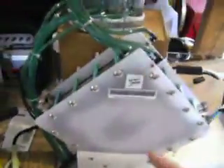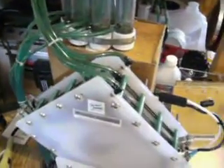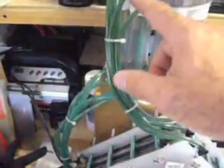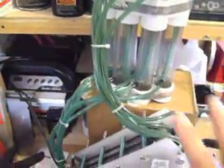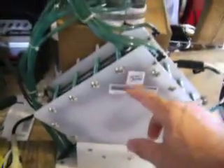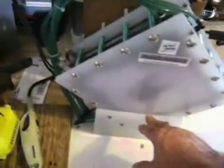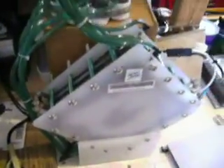There are a couple things to the self-circulating design. The circuit path is: gas out, then electrolyte back in - and the process of forming the hydroxy gas is the pump. Pressure is created in the cell, pushes foam and gas mixed together, and that production action pressurizes this entire circuit. As electrolyte is pushed out of the top of the cell, it creates a void - a lesser pressure than the top - and electrolyte is allowed by gravity feed to refill the cell as it empties, so it's a continual circuit.